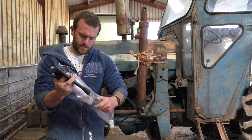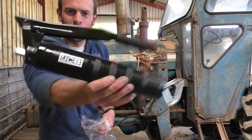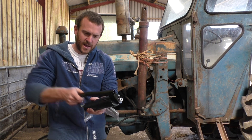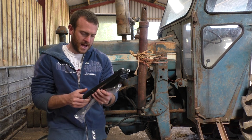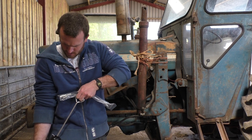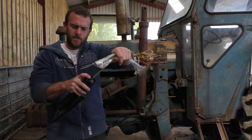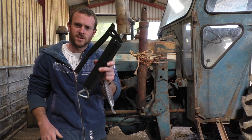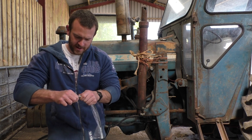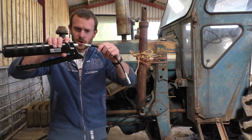First job — open the bag. Your grease gun might look something like that. You can get these in a pistol grip, one-hand operated, but because they can be hard to pump you want to get two hands on there. There's a spring on the back — pull that out all the way and it locks in place with a little button. Release that to take the pressure off, press that button down and it goes back in. There's a big spring in there — that's how it operates the grease. This has come with a flexi hose. You can get these in either a solid hose or a flexi hose; flexi hose is probably the better option. Screw that on the top.